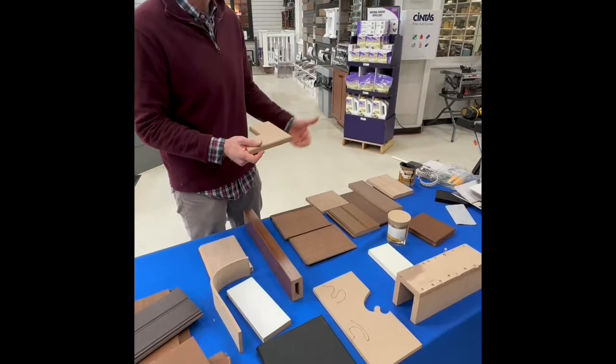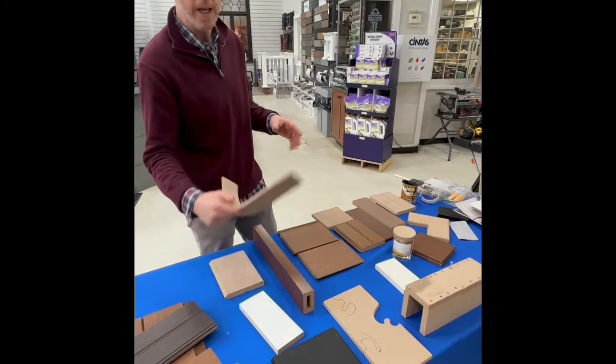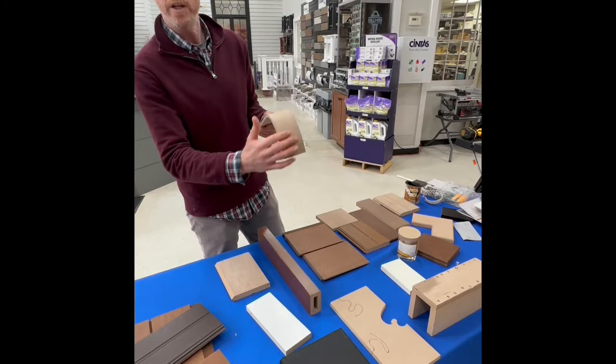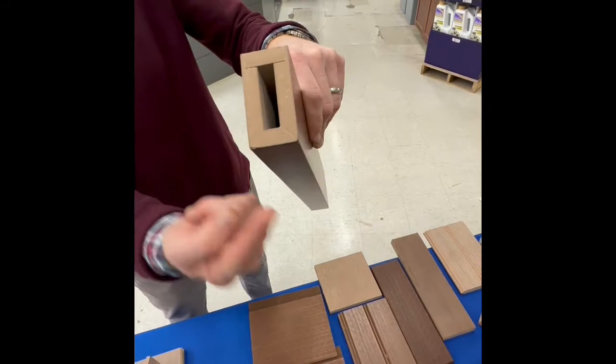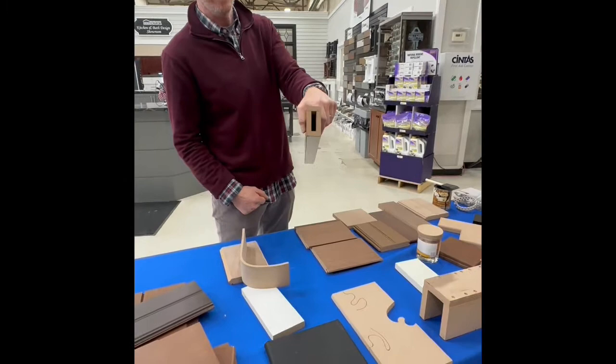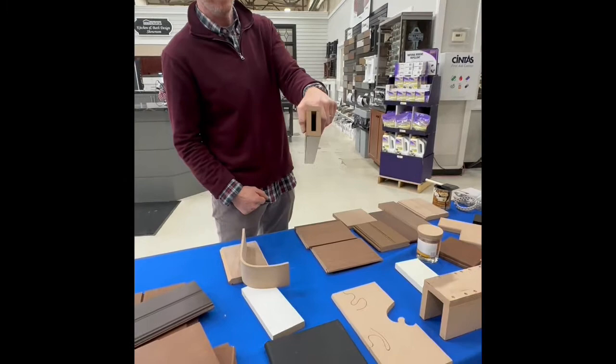Contractors find this really pleasant to work with in the field. Another feature is the heat forming and heat shaping potential. With simple application of heat guns or blankets, you can form this product to make shapes, or potentially cleats or coverings on a job site. We show here a three-sided bend done with relief cuts — setting the blade, cutting relief cuts, and folding the material, then staining it so it creates a false wall on the job.